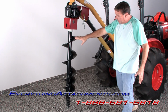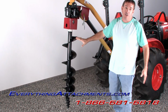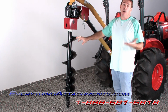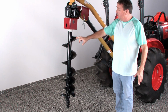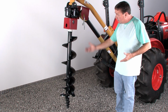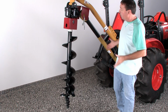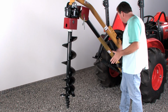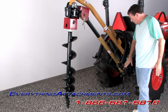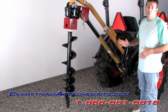This is a 48-inch length auger on this now, and I had 16 inches of clearance when I measured it, so that's enough. If I thought I'd never drill a hole over 2 feet, I still might put the 36-inch on it. They're the same price, just to not have as much hanging down on these smaller tractors. If I were putting this on a 30 horsepower tractor, you can still use the compact with either bit, and you probably would end up using the outer pins. But this has been a great digger for us over the years.